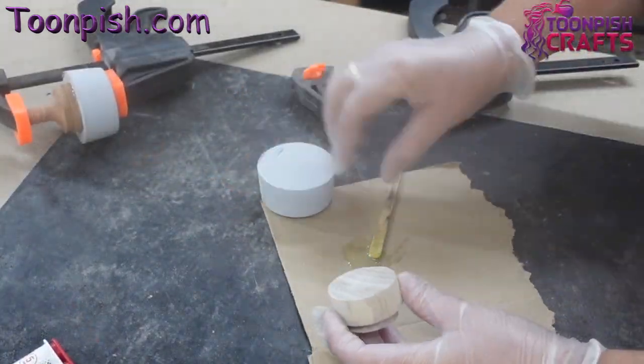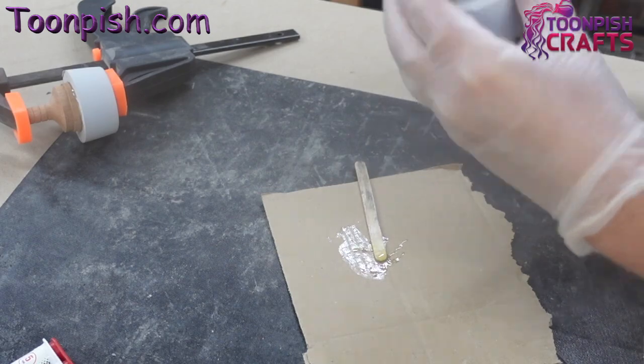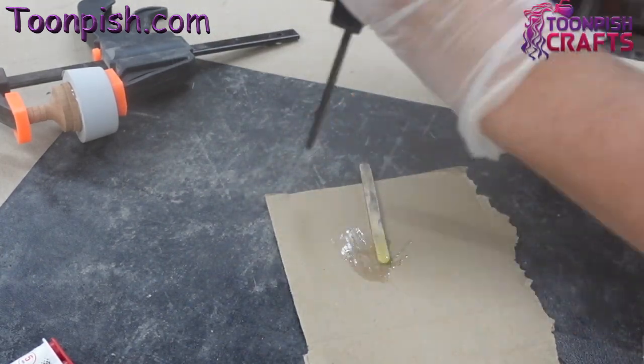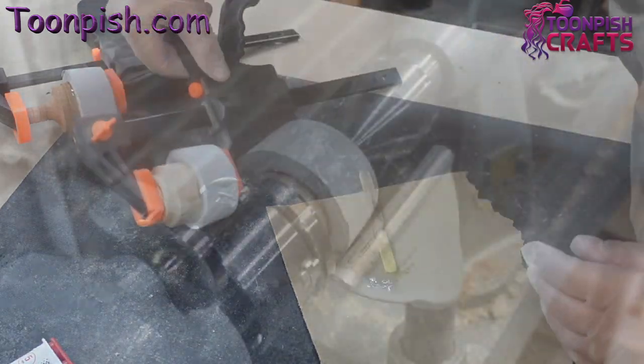The headstock one is really simple. It's just a waste block. If you can make a waste block, you can do this. Again, I've scored it and I'm sticking the non-marking mallet piece to the block, clamping it up and leaving it to cure. I only left them a couple of hours and they were solid, so that's all it needed.